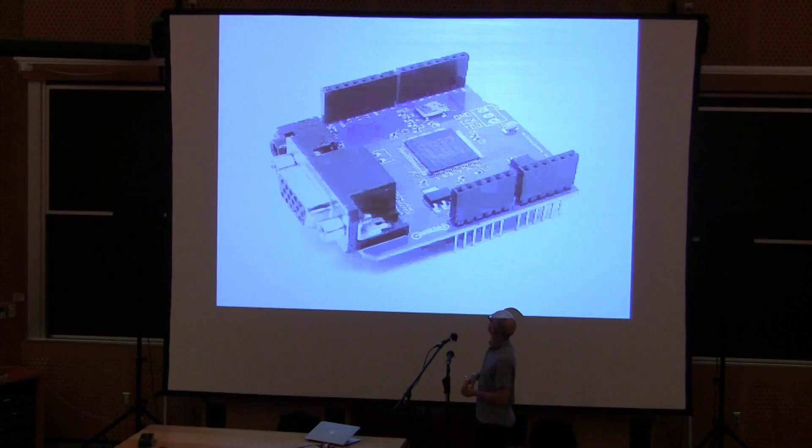It's an FPGA-based design. It's expensive by Arduino standards — the Arduino CPU itself is a $1 CPU, so we're in the world of fairly cheap parts. The FPGA is pretty fancy. It's running at 50 megahertz against the Arduino's 16 megahertz, so it's actually running faster than the CPU it's attached to.